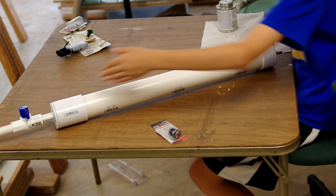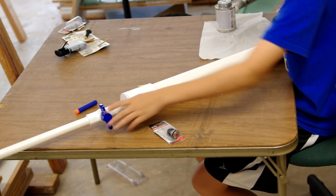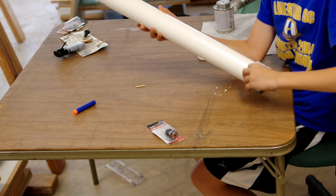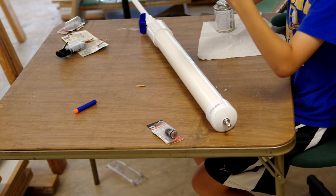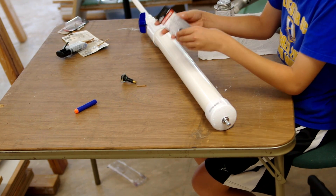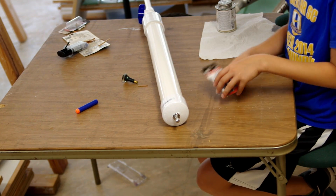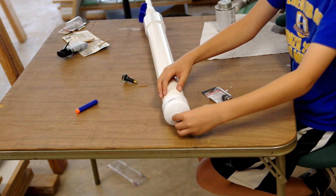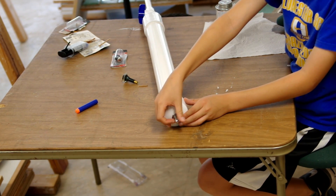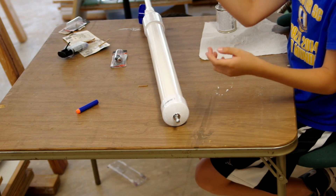We have a two-foot tank that can hold up to about 100 PSI or so. I had to cut off some of the barrel because the first tire valve I used went through into the tank, so we had to get new ones — you can get them at O'Reilly. We had to cut off some of the two-inch PVC, buy a new cap, put a hole through it, and install the new tire valve. These tire valves are twice as expensive but they have a bolt to hold them in.